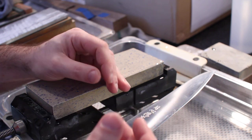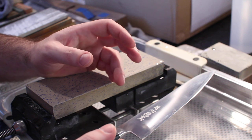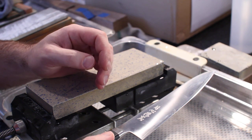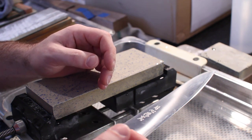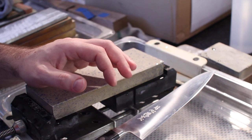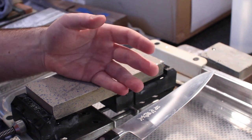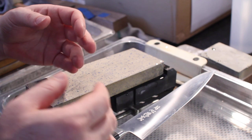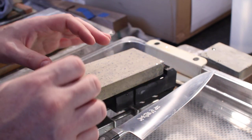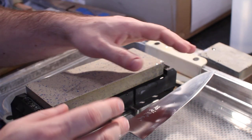When you see excessive flex, it means one of a couple of things. Either you have a wire edge or a residual burr — in which case you'll not only see flex, but you'll see part of the edge flip up and stay there. Or it means you've ground your edge too thin and it isn't going to hold up to the kind of use you'd expect. If you're noticing problems like a lot of chipping, deformation, or loss of edge retention relatively quickly after sharpening, this test can help. It may mean doing a better job removing burrs, thickening up your edge a little, or using a micro bevel to remove the weakest part of the edge.